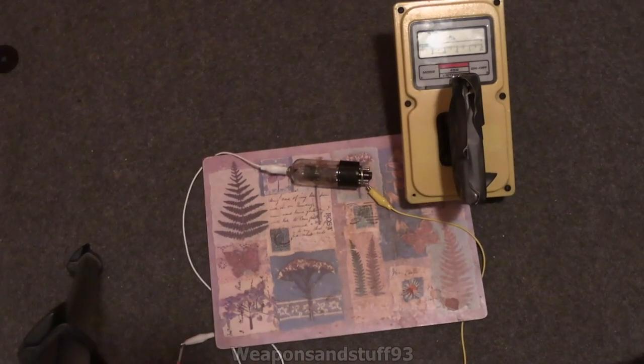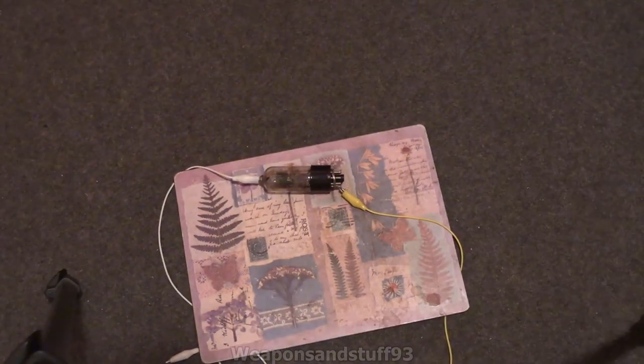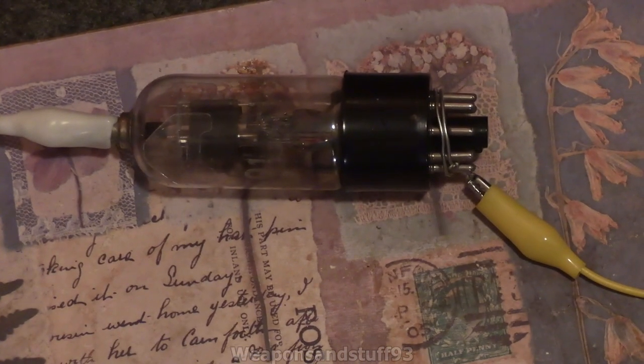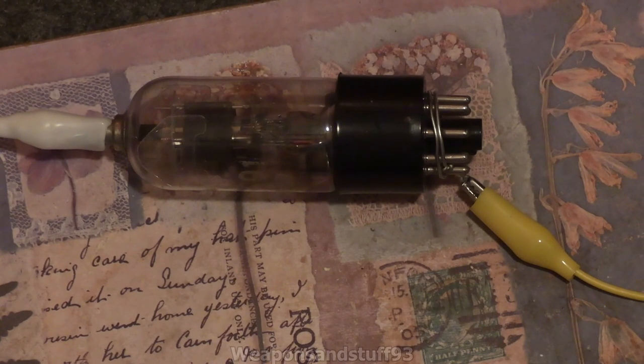So that's a quick demonstration of basically how vacuum tubes with high voltages run through them generate x-rays. This was actually a thing with CRT televisions because old CRT televisions used the cathode ray tube, which is a vacuum tube. In a cathode ray tube, if too much voltage went through it, it would produce x-rays, which is why they generally used leaded glass on CRT television screens. This goes back to 1895 — this is how Röntgen discovered x-rays by accident by messing around with Crookes tubes.